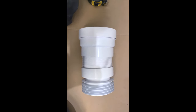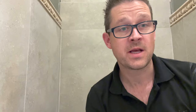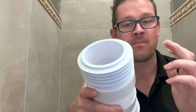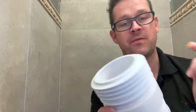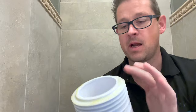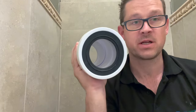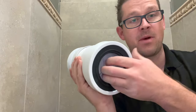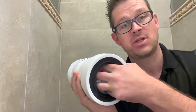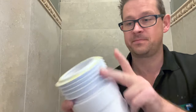If you've got a solid piece you could use that measurement to cut it down and it will work no problem. Get some lube — if you haven't got any lube, get some fairy liquid or something like that from around the house. Get your pan connector and put it into the soil pipe first, so give it a good smear around there — get plenty on. I don't put any on that side just yet, because when we're pushing it into the soil pipe our hands are there pushing it and we'll just get covered in lube. So we'll rub that around there and in it goes.